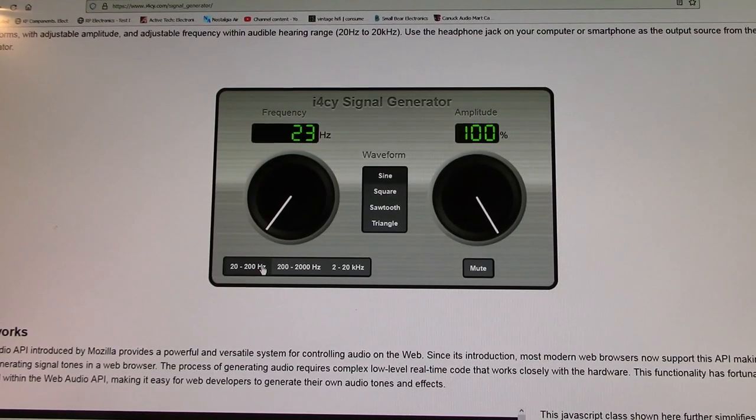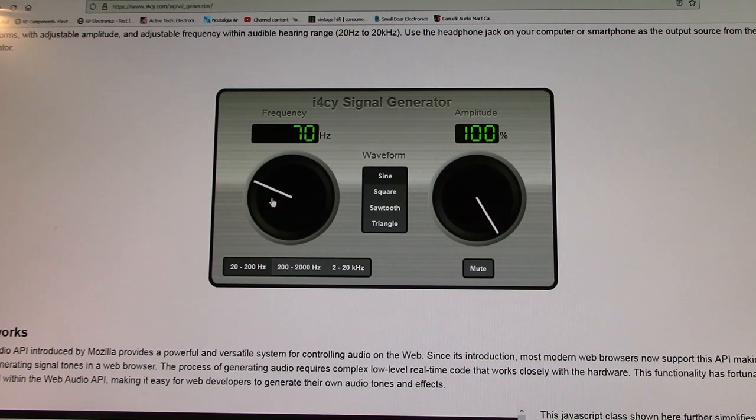I let the silicone set up for about four hours and now I'm itching to test it. Set up 20 to 200 Hz sine wave — let's try it. I hear a little bit of raspiness on the left side but it's not like it was before. That plywood is rattling again at 100 Hz — and a little bit of buzzing on the right side at 140, and a little at 154. It's not as bad as before. Let's try the left side alone.